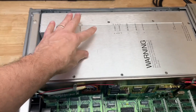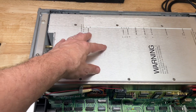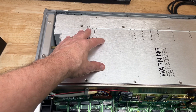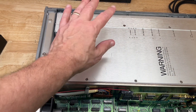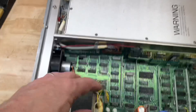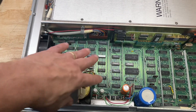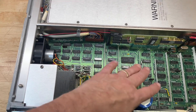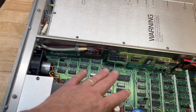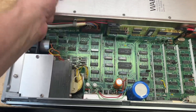Taking a quick look inside: the aluminum shield is called the guard shield. Everything inside it is the in-guard circuitry, including the in-guard power supply, all the analog circuitry, and all the measurement circuitry. Outside the shield is the out-guard circuitry: the controller circuit, out-guard power supplies, the front panel interface, and the main processor. There is also a link between in-guard and out-guard for data communication.